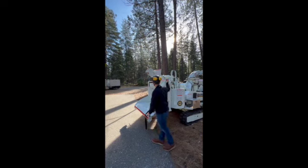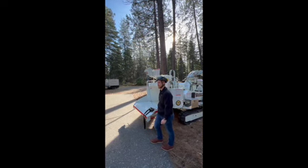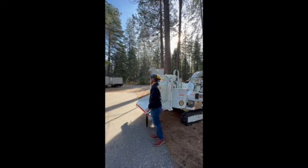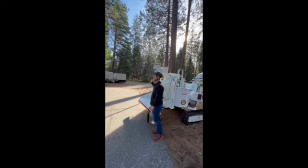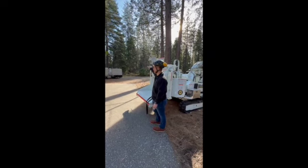Just remember, engage, disengage. If that light is on up top, that sensor is not being pushed. You do have about 13,000 pound pulling capacity on this winch. This rope is rated for 5,000 pounds, so this rope is going to snap before your winch gets damaged. You guys have any questions on the winch, how that system is working?